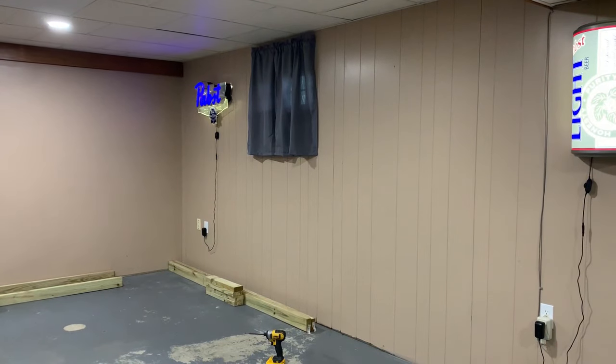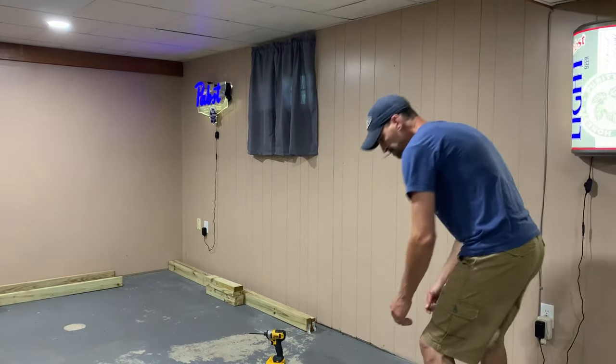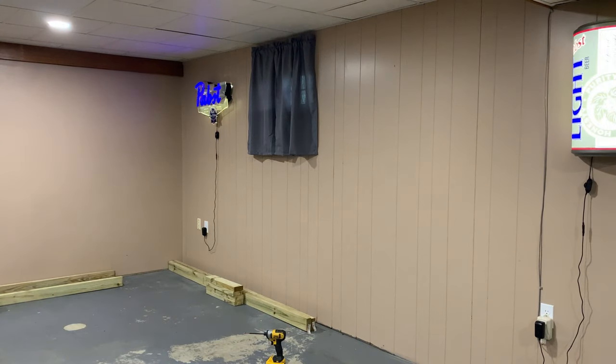For those of you that were curious about the lighting in the basement — I got these from Amazon. See how thin that is? It's really just an LED panel. What you do is cut a six-inch hole in the actual drop ceiling tile itself, which is really easy to do because that's basically like foam. I'm going to leave a link for these in the description below just in case you think you might use those for any kind of projects. It's really nice if you have a low ceiling.